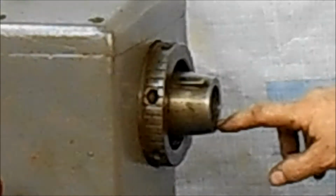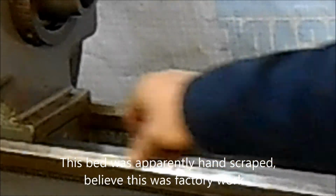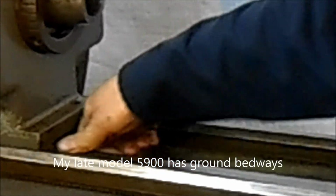The spindle looks reasonably good on it. It looks like somebody did ding it on the inside, on the socket. It's got about 1/8 of an inch of extra relief on it. Probably didn't come that way from the factory. I'm thinking that was just somebody messing with a cutter that didn't quite know what they were doing. The bed on it's pretty good. It's got the original flaking on a good part of it, and there's really no chips or anything on the ways at all. It's got some wear, but not too bad, and it's got almost no dings on it.